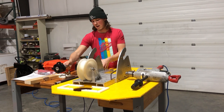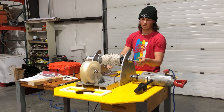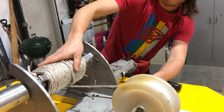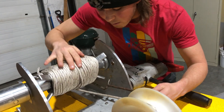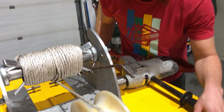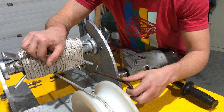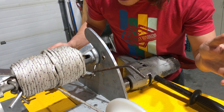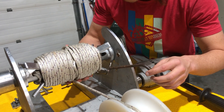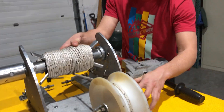The final thing is the brake assembly for the rope winder. You can see this handle here — when you're tripping down hole or tripping out of the hole, you can capture the rope winder using this brake. The brake latches into the tongs here. So you can imagine you're paying out, paying out, paying out, then you engage the brake. As you grow more comfortable with the Sidewinder, you can actually just spin the drill in reverse a little bit — that'll drop the brake automatically, and you can keep tripping down hole until you want to stop and add your next extension.